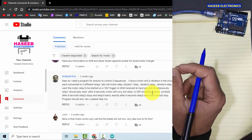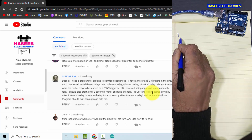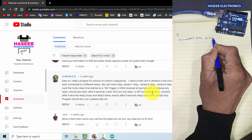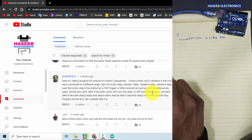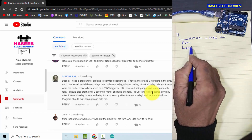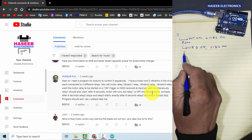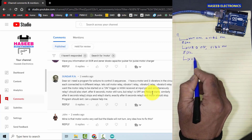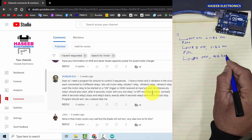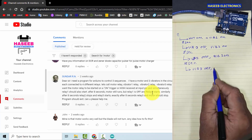Let's see the program structure — it is very simple code. When a pulse arrives high, motor on plus vibrator number one on. This is our first condition. Then delay eight seconds, vibrator one off, vibrator two on. Eight second delay, vibrator two off, vibrator three on. Eight second delay, vibrator three off, motor off.